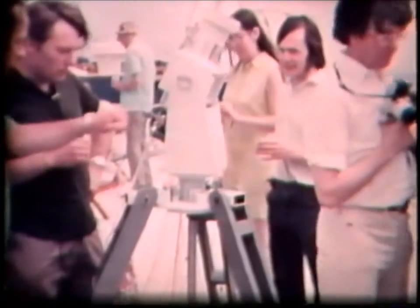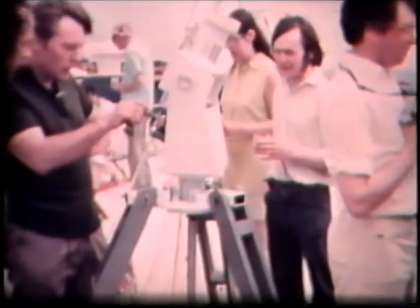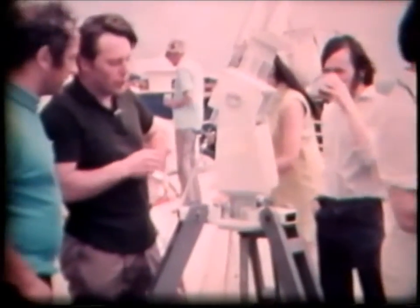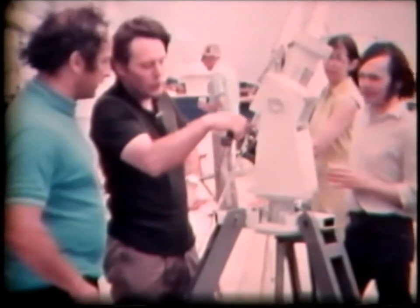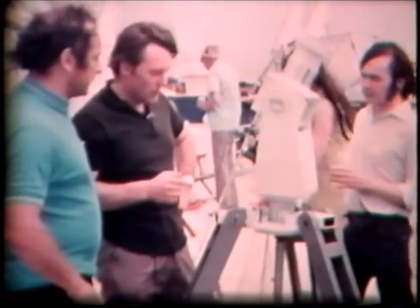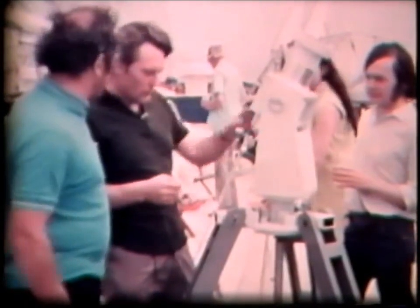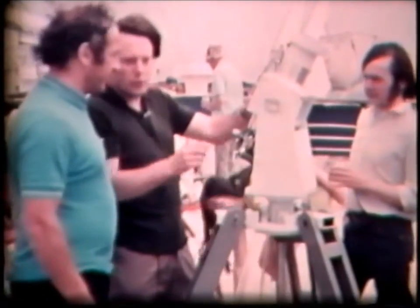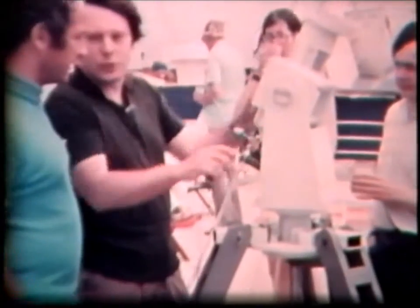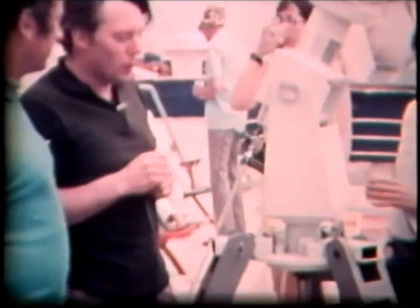And what's this gadget? Well, this is the shutter release for the camera — fairly standard shutter release — so I had to make a special right-angle fitting to get into it to allow for the telescope. And this will hold it still for the eclipse? Well, I would hope to. It should certainly — on the trials we've done so far — damp out about 50% of the movement. The rest of it should be able to compensate by hand.